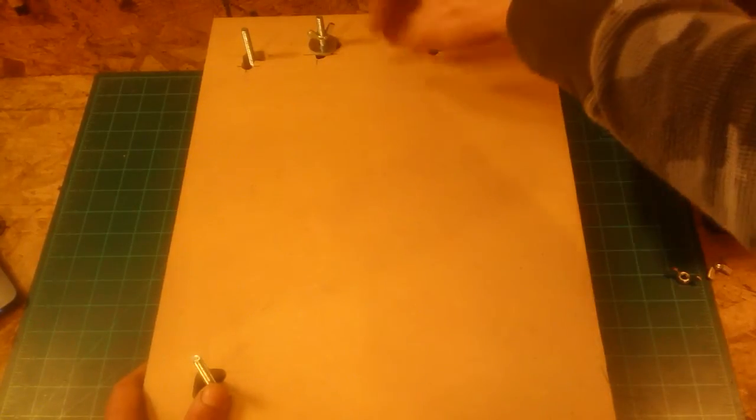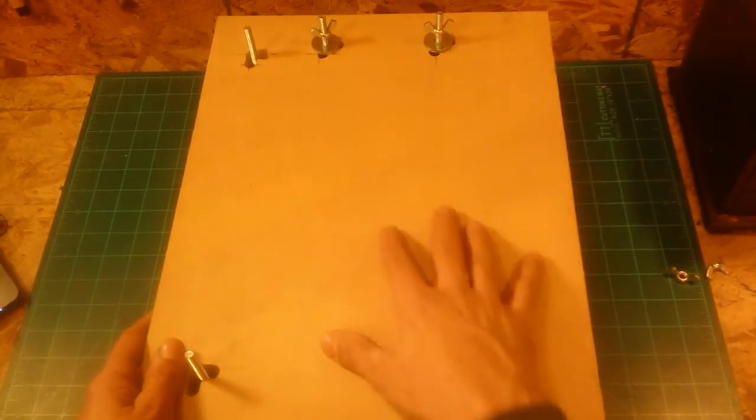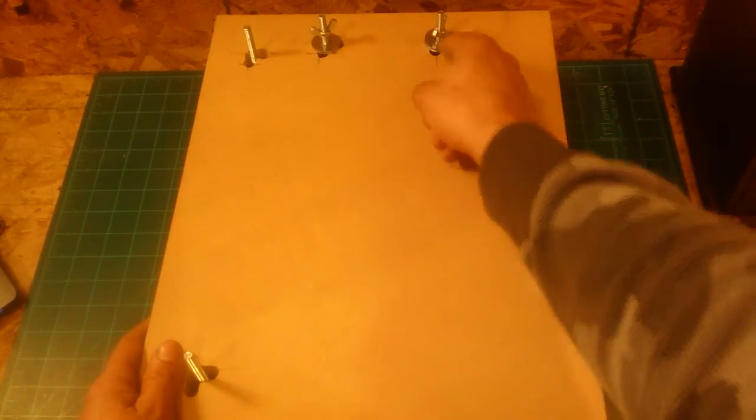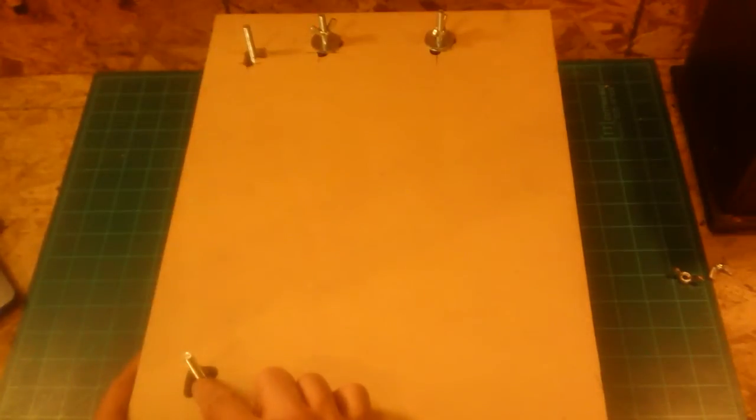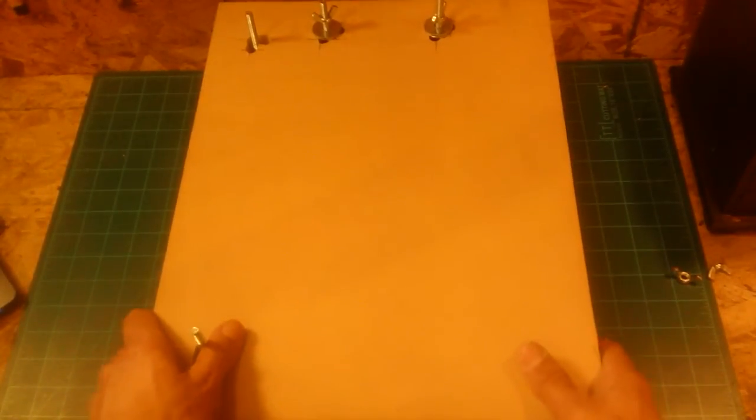And these wing nuts are what allow you to set your pressure there. If they're too loose, it's going to rock upwards, going uphill like that. The washers are there because these openings are so big, the washers cover them. That way you don't have the wing nuts going into the hole and causing an issue.